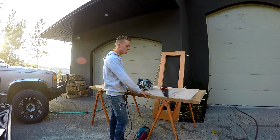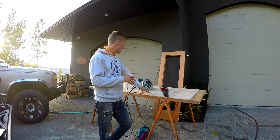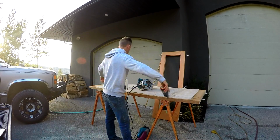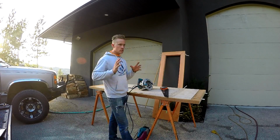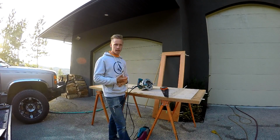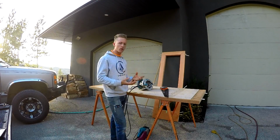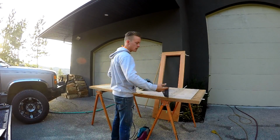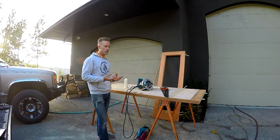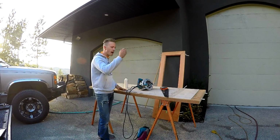With this main front door, it was a bit of a challenge because I used this old slab from the door before, and it's particle board inside, so I had to re-rip the top, bottom, and the edge because the last cabin I custom made it to fit my opening, which wasn't perfectly square and straight. In this cabin it is. I made sure of that, so I had to re-square this up, but all these edges are just particle board. So I glued as much as I could and pinned it, and the top and bottom I put dowels through, but still there wasn't a lot of support because there's no solid wood to glue to even. With a hammer you could pop this off.